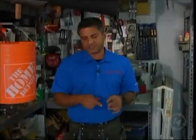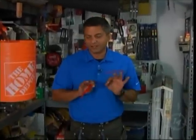One of them, the top is fixed. The other, the top rotates. Either way, both of them are going to be useless. In 10 years, I can't tell you how many fences I've gone out to repair that are leaning. The fence just comes apart. And please, don't ever set a deck on these. A lot of homeowners try to set their deck on this.